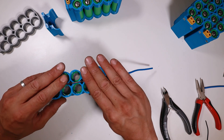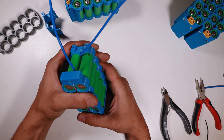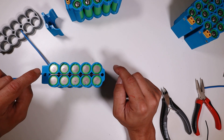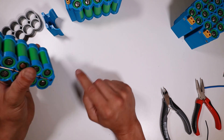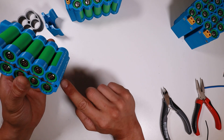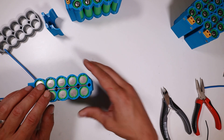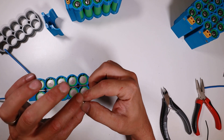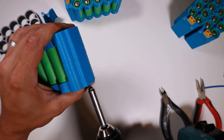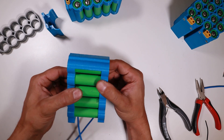Like I said in the beginning of the video: take your time and prepare the plastic parts first, otherwise you'll end up like me, disassembling everything a couple of times to make sure all the supports are out. I use this side so that the screws are all on the same side. There's a space of five millimeters at each side to torque in, that's why I drilled it out at two and a half millimeters. This is where the first bolt gets in — the 20mm, 25, or 30 millimeter. And there you go, pretty solid pack now.